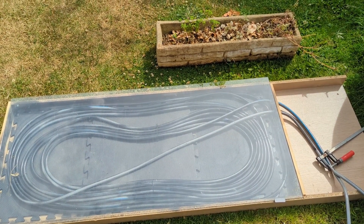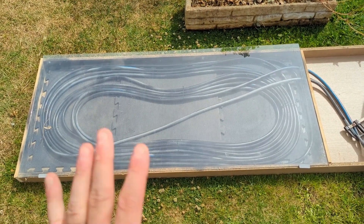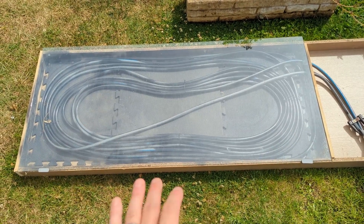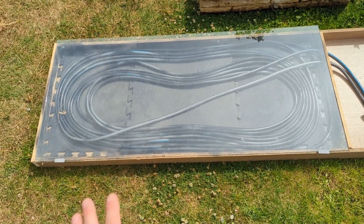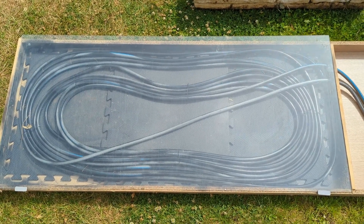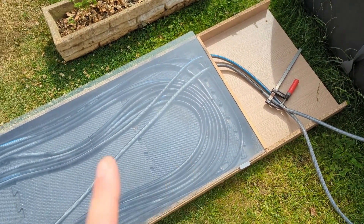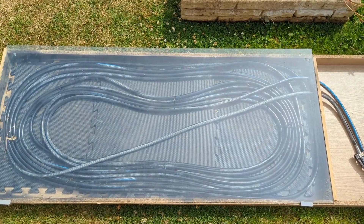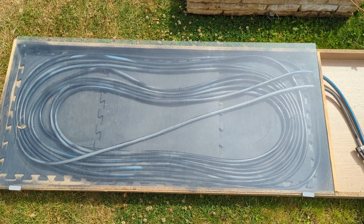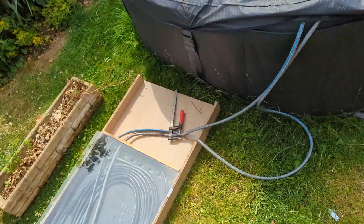So that's a quick overview of how to make one of these solar heaters and whether they actually work — and they do. All you need is a quick wooden frame, hose pipe, some black paint or insulation mat, a glass or plastic bag top, somewhere to regulate the flow, and a pump, and you're ready to go. If you liked the video and want to try this out, drop a comment, hit like, subscribe — thanks a lot!